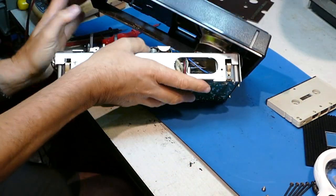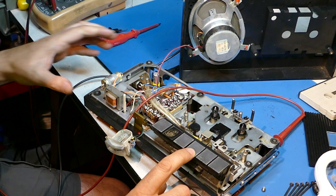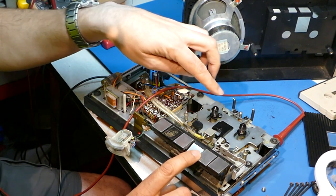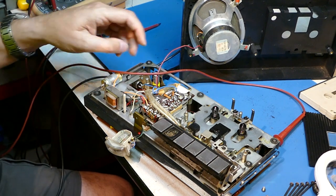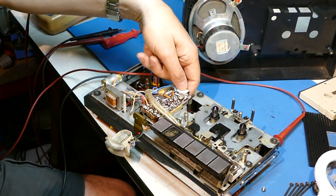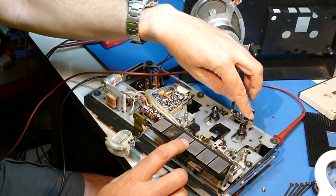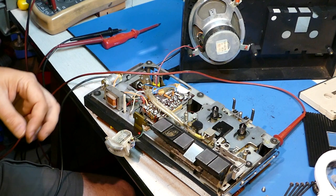Let's see if it makes a little bit more sense now. Switch power supply on — nice and quiet. Press the play button. On. That's correct. That's the right way around now. But what's not happening now is the motor's not spinning. Why is the motor not spinning? Let's manually turn it a few turns and try again. It might have dead spots on the motor. That seems to be working. That does imply I've got dead spots on the motor.